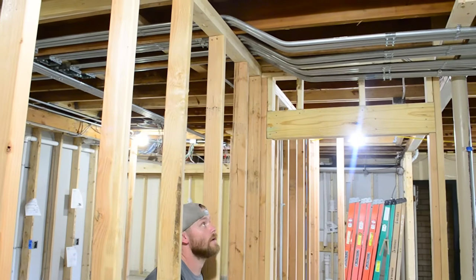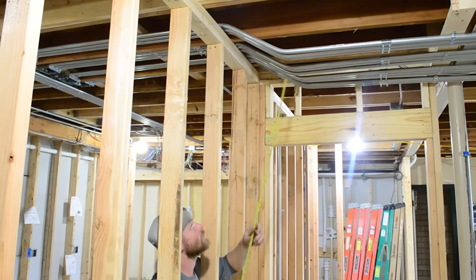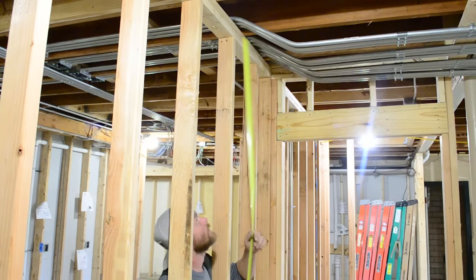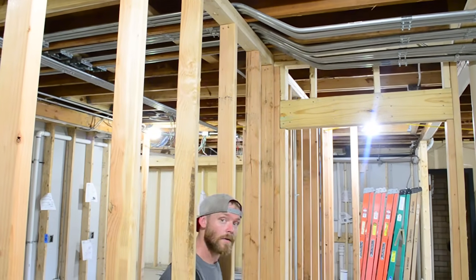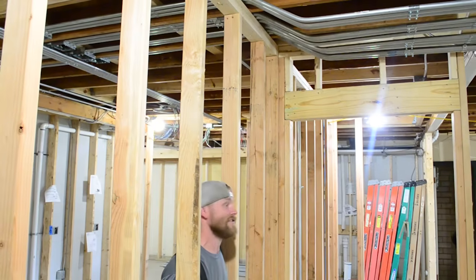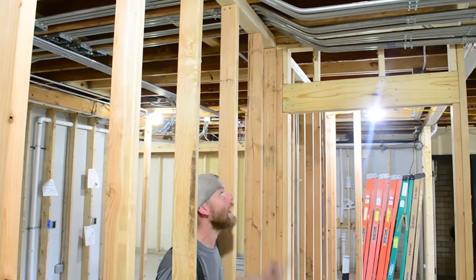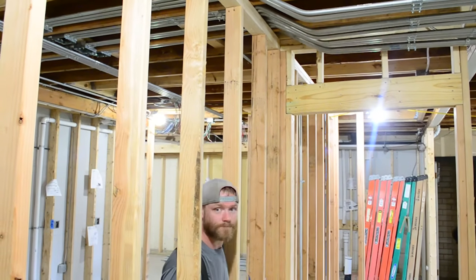All right, so the last thing that I talked about, I just want to show you on an actual practical job. This is what you would call just a standard offset. So this is where you're at one height, but you have an obstacle that you have to clear. This one in particular is a 30-degree offset. So you can do 30-degree offsets, 45-degree offsets, and 60-degree offsets. You can do 22.5-degree offsets if you want. There's all these multipliers to figure out the math behind how you achieve that. But again, that's just a regular offset.